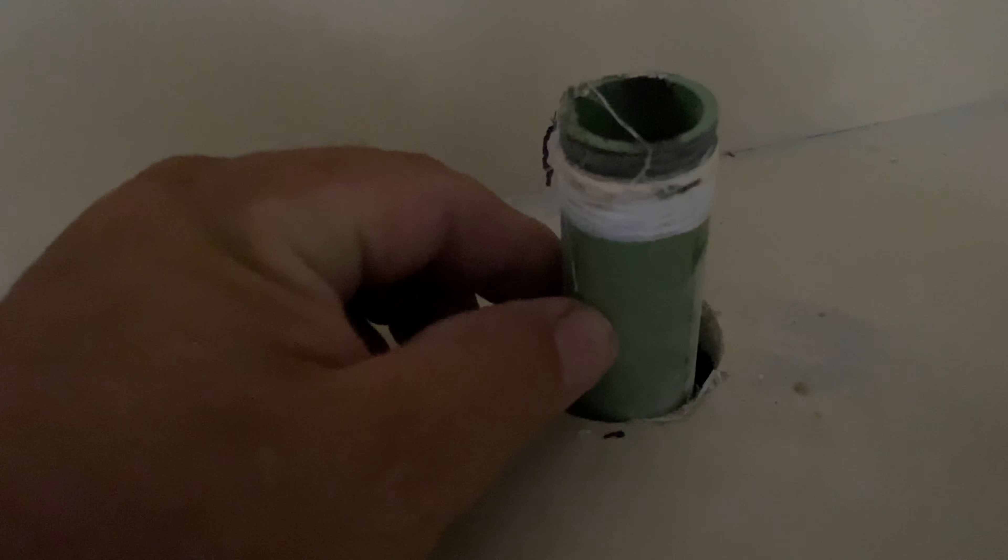As you can see this is three quarter inch. See how this is not right here? Somebody tried to use the white tape — you need the yellow tape for gas. So the previous installers have done this, but we're going to correct it.